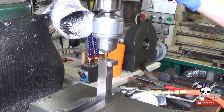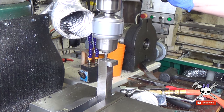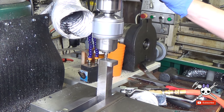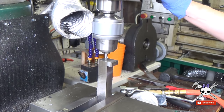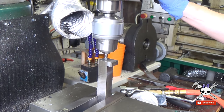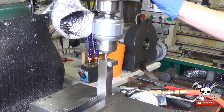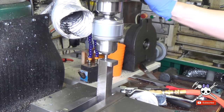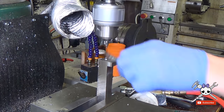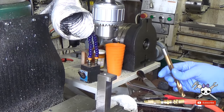A half inch hole will be drilled into the end of the slide. This is where the barrel will eventually go through. The hole only really needs to be drilled in about a half of an inch, but I'm actually going to drill in about 3 inches. The reason for this is there's going to be a bunch of material that needs to be milled out in that area. By drilling the hole really deep, basically I will save myself a lot of milling later.